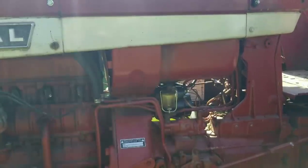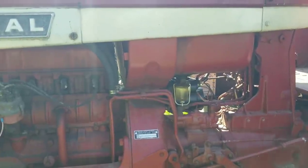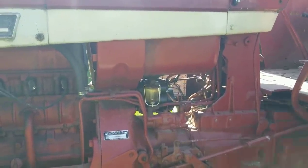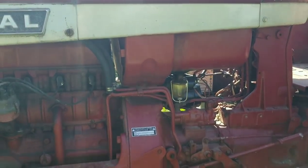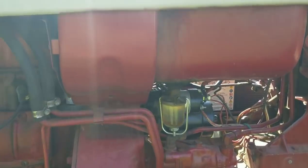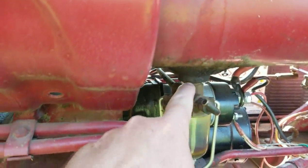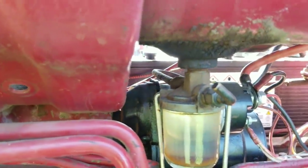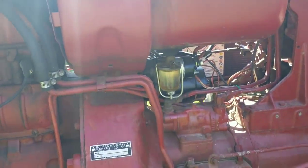I'm going to tell you, in your carburetor, there's little teeny weeny ports. They're not microscopic, but they are tiny, tiny ports. And it doesn't take much to clog a carburetor. And it doesn't take much to stop flow from coming out of the tank right here at the top of that petcock. Okay? And a little trick, most of you guys are going to know it. It's no big deal.